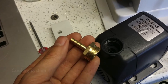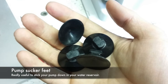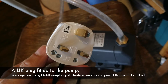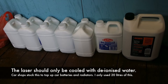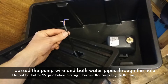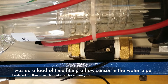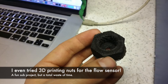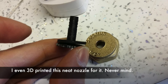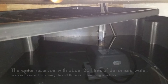The cooling system was relatively simple to set up. The most important thing is that you must run the laser with deionized or distilled water, because otherwise you might get limescale deposits inside the laser tube which will obviously decrease its useful lifespan. The only problem with deionized water is that it degrades steel and possibly other metals, so I used a plastic water reservoir. I've seen some blogs where people have built pretty cool radiators to reduce the temperature of their coolant water. I've never found so far that that's been necessary. I have 20 litres of water so it would take quite a lot of heat energy to warm that up significantly. Probably the mistakes that I made with the flow sensor was buying a cheap model and one which was intended for a wider diameter of pipe. It really didn't work out but it's not my priority to fix that.